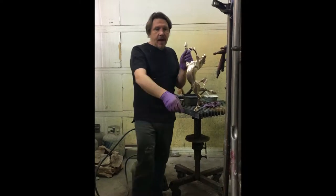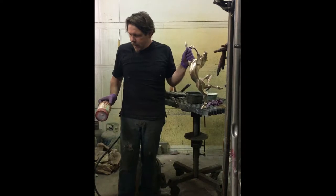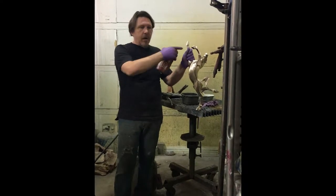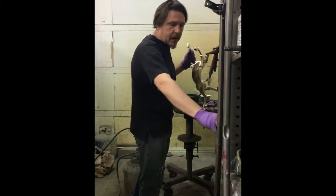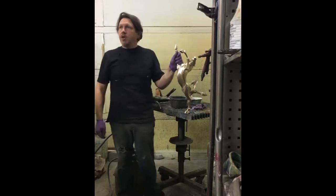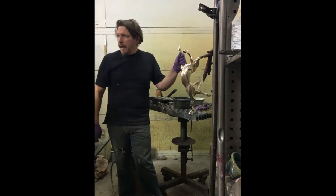And then I've got this acrylic pigment, acrylic paint, that's an airbrush pigment that when I put it on top of those areas, I bring the temperature back up to about 150, 180 degrees, and I airbrush that on, and it turns all of those edges gold, and it deepens the color in the piece.